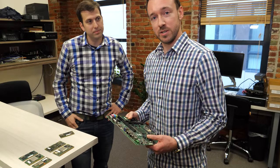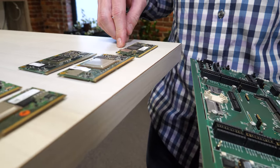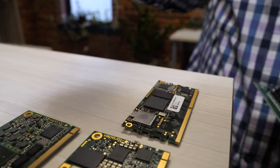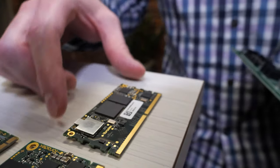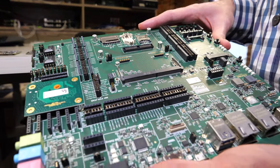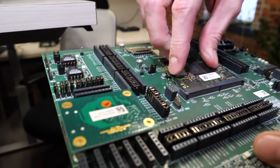I'm Brandon Shibley, CTO of Toradex. When we designed Verdin, we were bringing out higher-speed interfaces than some of our previous products. Colibri is a 15-year-old family. With Verdin we're bringing interfaces such as USB 3.0, Gigabit Ethernet, PCI Express, MIPI DSI, and MIPI CSI on a higher-density 260-pin connector. This is the development board that we created — the board you'll work with when developing a product with our Verdin system on module. You can see it connects in just like this.